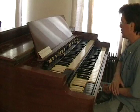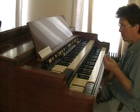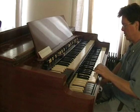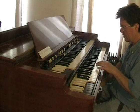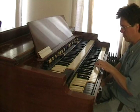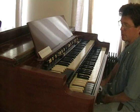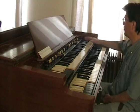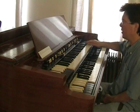This is on 888 on the top manual and 808 on the lower manual. One of the things I've got an issue with is that although there's a fair amount of bass, it's a bit soft and woolly sounding. What I don't know is whether this is the nature of the organ or whether it's the capacitors on the generator causing this problem. The preamp has already been rebuilt so I know it's nothing to do with that. There is plenty of top end on it.